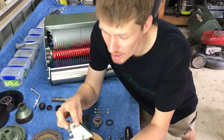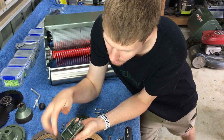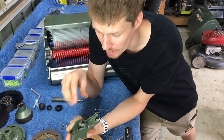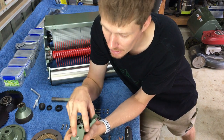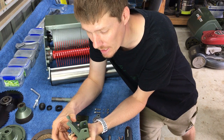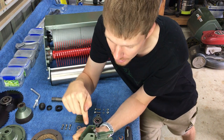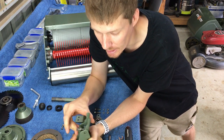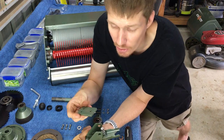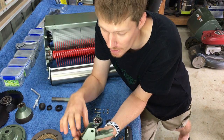Okay, so the clamp wasn't needed, however you'll see that I've got the shaft through there, I've got my spring on the shaft, we've got the clutch fork there, and we've got our adjustment bolt in. So basically you can now press that up with a bit of resistance, however you can still get to the screws and nuts and bolts that bolt it down to the mower. So next step, we'll put our steel plate on the bottom, and then we'll mount that onto the mower. So that's just 3 nuts and bolts, quite simple.